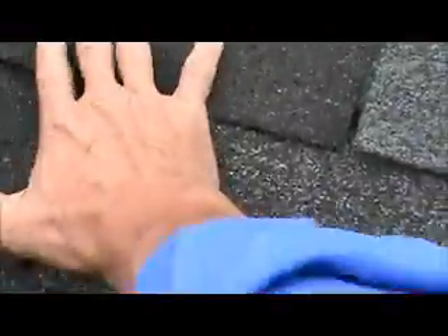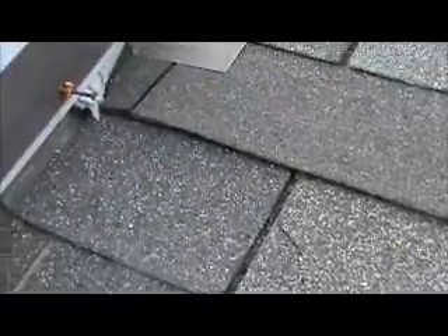Let me see if I can get to the front here and try to get the whole skylight inside. You can see there's no leaking. The wood's fine. All you've got to do — they didn't want to nail the step flashing. It might leak. It's in the keyway.